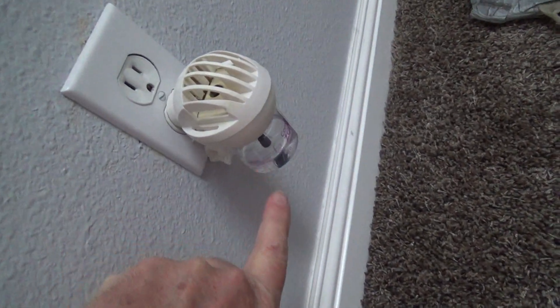That's for 15 amp. Now when I pull the old one out of the wall, I know it's going to have 12 gauge wire. So what I'll usually do is strip this — here's my 12 gauge wire — and I try to eyeball about an inch. I'm pretty close at an inch right there.